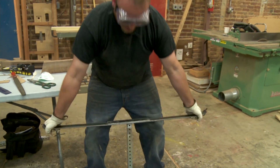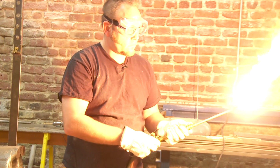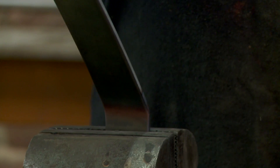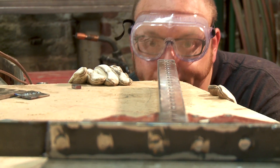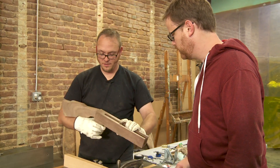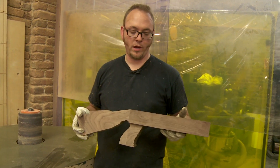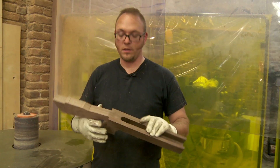The reinforcement made it so difficult for the bow to pull. This is an acetylene torch, but instead of using it to cut the metal, I'm just going to use it to heat up the ends of the bow. These are the little pegs and I'm going to bend them forward so it would be more difficult for the bowstring to come off. I'm going to do a critical part right now — I have the center beam and the bow and I'm going to weld the center beam to the bow. I also want to remove the rest of the material on either side of the grip; it's a little too fat to hold right now — unless you had a weird T-shaped hand. So now I've taken off all the large chunks and the artistic part begins, using shaping tools, feeling it, looking at it, until it feels and looks nice.